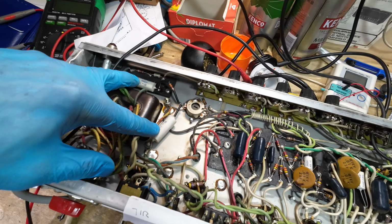And a 40 watt bulb in. So now I've got 140, and you can see the voltage is going up now. So we've got signal, you see the plate volts dropping there because I've cranked the amp. So we drop that down, you can see that plate voltage increasing now, and the current's down to 290 milliamps. Choke is cool still.